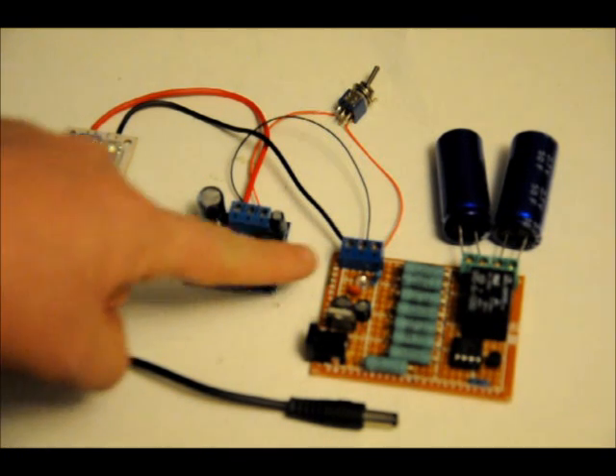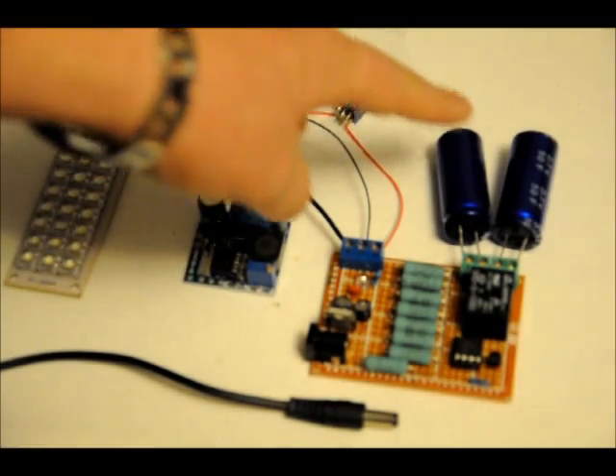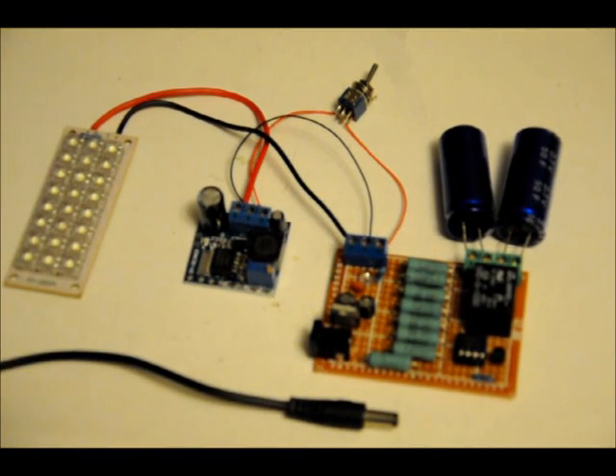When you plug it in, this little green LED blinks three times and then charging commences. The microcontroller instructs the relay to turn on, which begins charging the supercapacitors through this resistor bank. I didn't have the right resistor, so I'm using a bunch of 1.8-ohm resistors in series. Once you start charging the capacitors, there's an ADC — an analog-to-digital converter — sampling the voltage. Once the voltage reaches 5.2 volts, the maximum being 5.4 volts in the series bank, charging will stop, the relay will turn off, and the green LED will continue to blink.